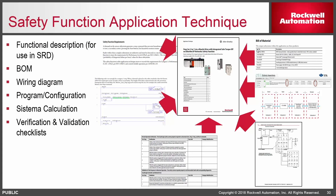Rockwell does a great job documenting a wide variety of safety application techniques and safety functions. They provide example PLC programs, HMI programs, verification and validation checklists to verify your system is meeting the designed performance level, as well as the maintenance tasks needed on a regular basis to maintain that safety integrity level. If you go to Rockwell's website and type in 'safety-AT' — AT being application technique — you'll see all of them, or add a space and something like 'safe torque off' or 'gate switch' to get examples addressing exactly what you're looking for.